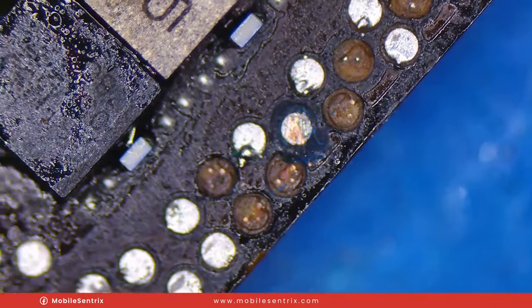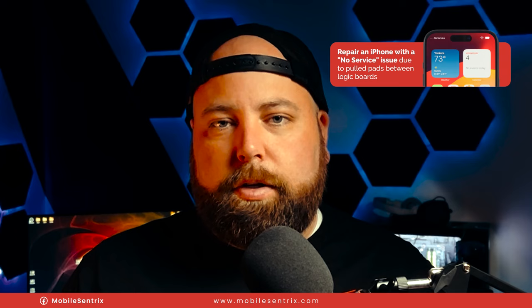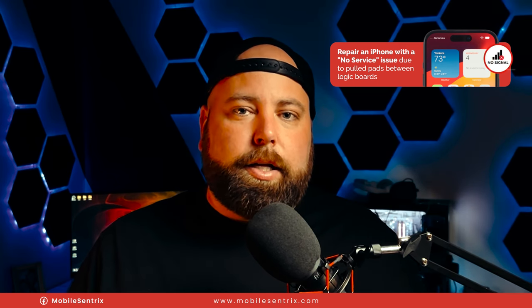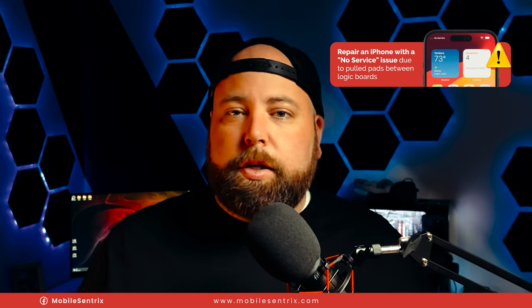One of the issues I see with a different technique is using a hot air gun to install the pad, which if done properly is completely fine. The issue is applying too much heat — sometimes throughout the process of using a rework station you can heat up the board so much that the solder melts under components that have underfill, in which case you get squeeze-out which can inevitably short out the device. You could potentially also float the CPU, which can cause issues if you try to inject power into the board — resulting in a completely dead phone where even a reballing of the CPU isn't going to fix it. This method using a soldering iron as the only form of heat is my preferred method for that and many other reasons. If you do something different when repairing these pads between logic boards, leave it in the comments below.